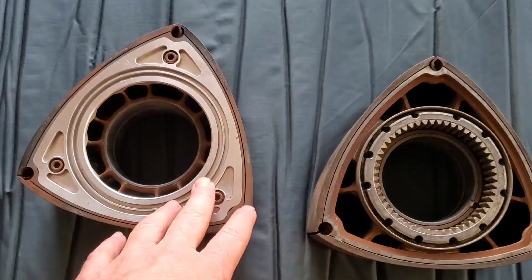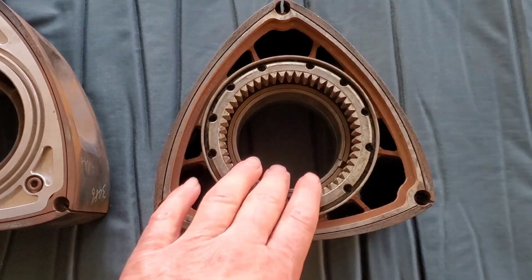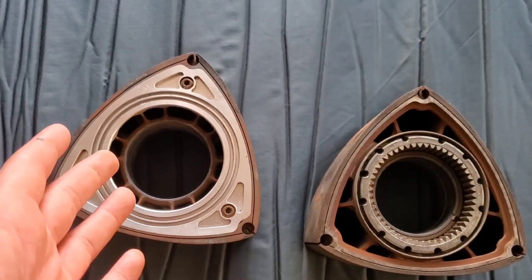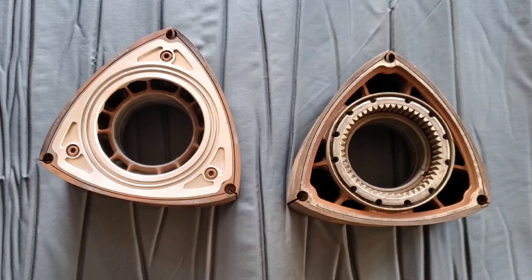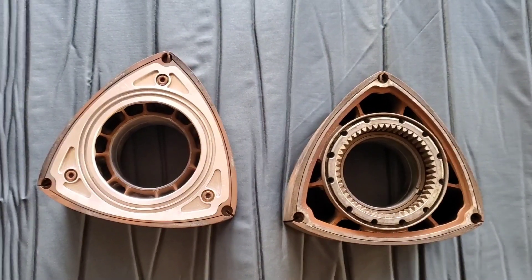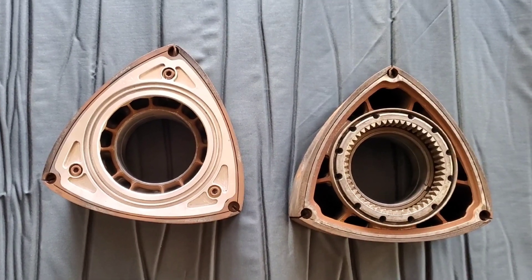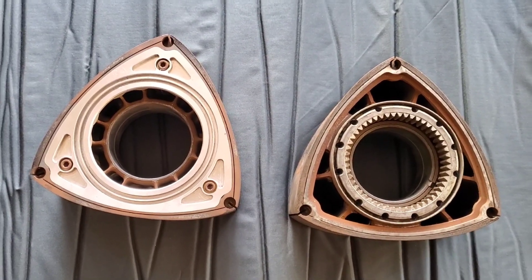Not only were you cutting the face off, but it also made it a lot easier to do any type of internal lightening on the webbing. And if you really start to think about it, you don't need as much internal strength if you're cutting the rotating mass down significantly. This was a way to do testing on extremely light rotors and explore the concepts of using multi-materials in rotors.